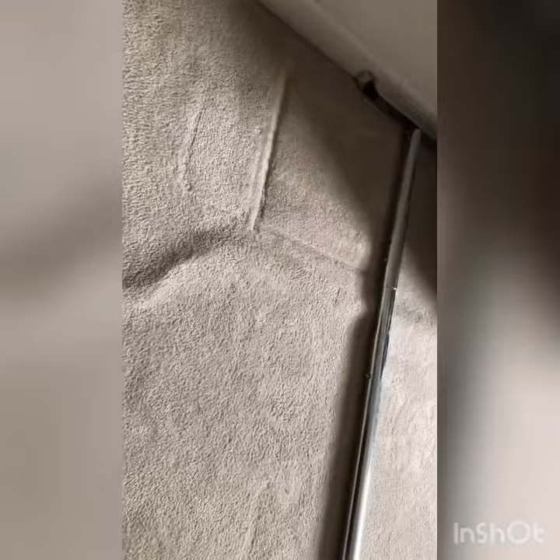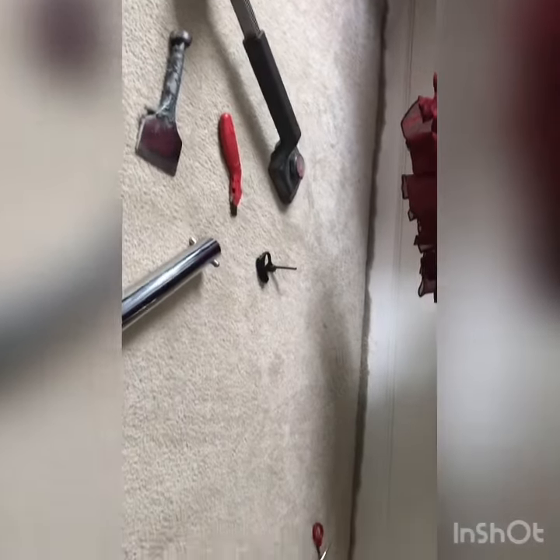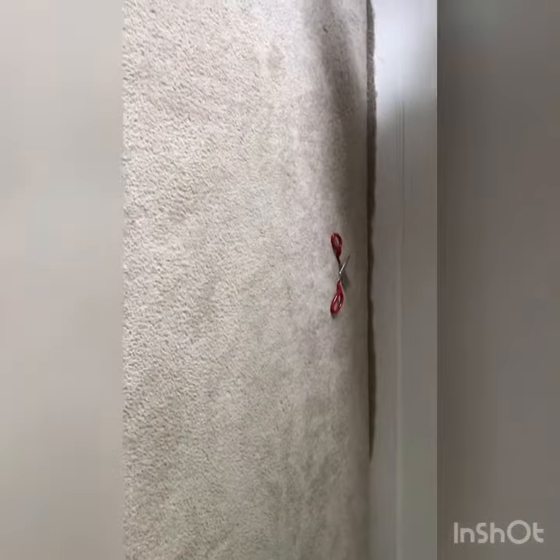And I am back, and the wrinkles are gone — they have been stretched out. In fact, this excess carpet along the baseboard is the direction in which I pulled, since that's the way the wrinkle was facing. So I'm going to take my knife and trim the excess carpet and tuck the edge up underneath the baseboard for a nice, neat finish.